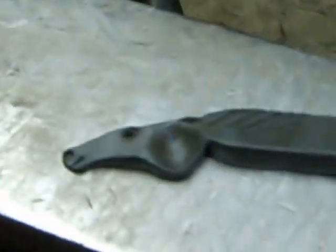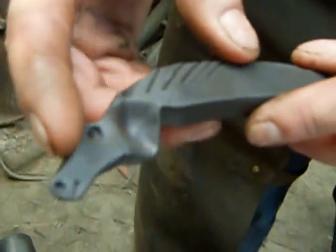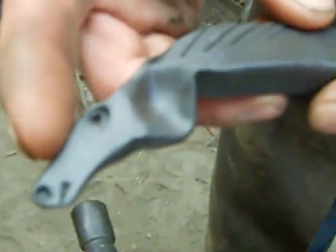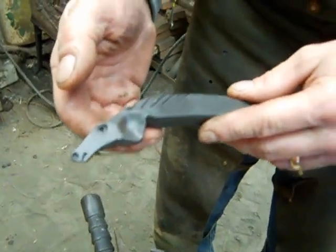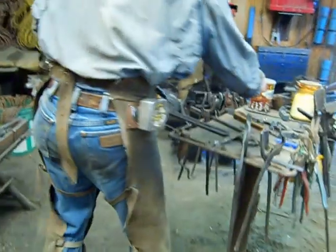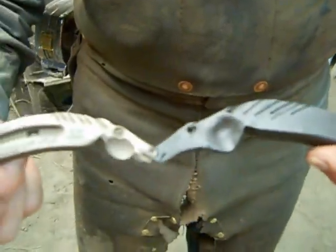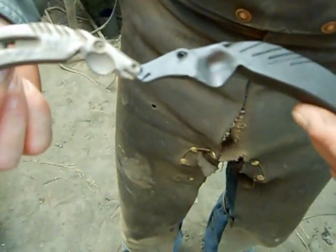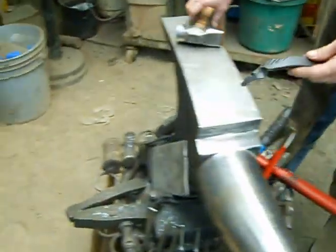I'm practicing this with the hammer - it gives me good control. As you can see, we've got a horse head now. I can pound it to give it the shape, and most of the time I make these out of a horseshoe. It allows you to see where your hits are gonna be. They really do come out pretty close. Next thing I want to show you before we move on to the power hammer is drawing out metal.